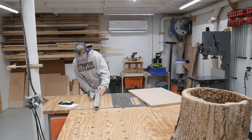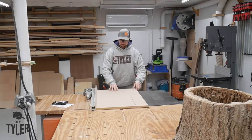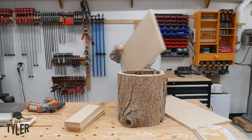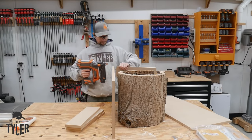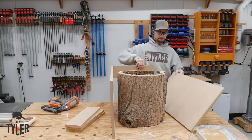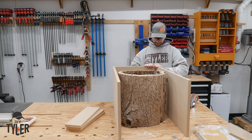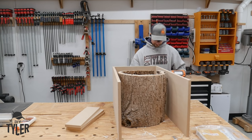The first thing I needed to do was make a form so that I could slide my router sled on it. If you're doing a big slab you need to flatten, you would typically use two-by-fours or a piece of metal — something nice and flat. The edges of this MDF we just cut will be absolutely perfect. I cut a couple of pieces shorter on the miter saw for cross members, giving us a nice flat form, then slapped a little router sled together that my bigger router will slide through to flatten both sides of the stump perfectly flat.